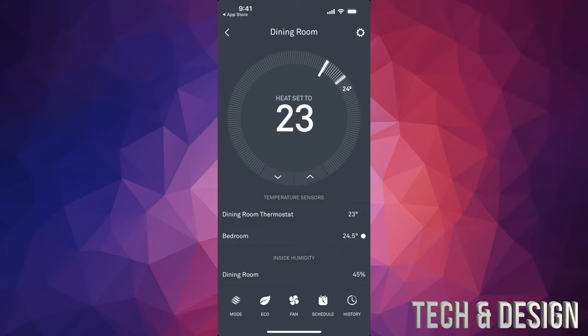It's not even going to look at what temperature the dining room is at. The dining room could go down to, say, 20 degrees, and that's fine — it cools everything down until that particular bedroom is at 23. Or in winter, it will bring the temperature up to reach 23. Whatever temperature other areas of the house are at, it doesn't know and doesn't care — it just focuses on that bedroom.